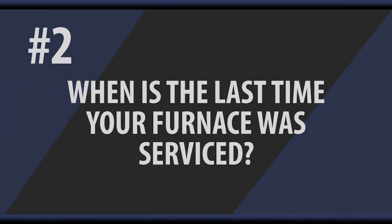The second thing I told them is that they should make sure if their furnace hasn't been serviced recently in the last year, they should have their heating system checked by an HVAC professional. At a minimum, you should change your furnace filter. Depending on what kind of filter, that's every six months or even more often than that.